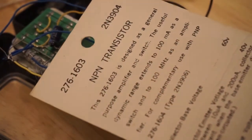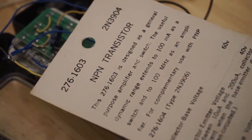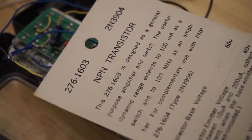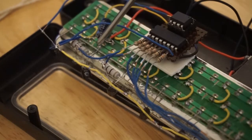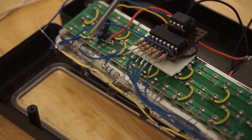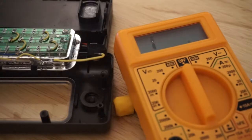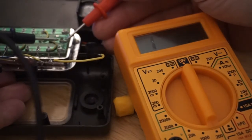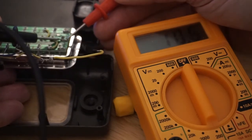This is the original packaging in which they came in, and the pins were very tarnished. Had to do a lot of sandpapering to expose the metal underneath so that it could take solder. The current passing through the LEDs is limited via these resistors that were already part of the worklight circuit. However, in cutting the copper traces, I've bypassed some other surface mount resistors. Let's see, so these surface mount resistors got bypassed. They're no longer part of the worklight circuit. They seem to be about 10 ohms.